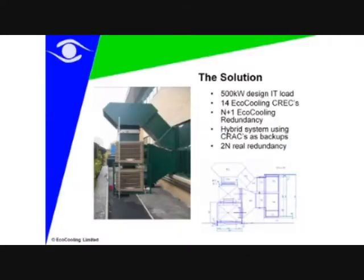This is what we actually ended up with. These are two stacked coolers sitting at the bottom, with side discharge coolers pushing air in. We remove a window and allow the duct to go in there, which then goes into the raised floor. The top duct carries the returning hot air from the hot side of the data centre.